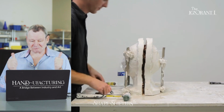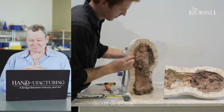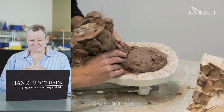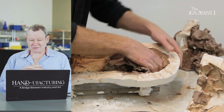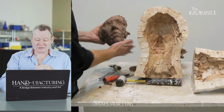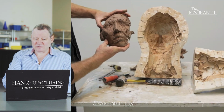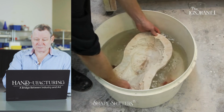The type of mold we're making here is a waste mold, which means not only is the mold wasted after one cast, but also the sculpture is often wasted in the process of pulling apart this mold. A lot of people sculpt in oil clay. But this is okay if we've made a good mold because the sculpture is captured in the mold in the negative. Once you've cleaned out as much of the clay as you can, you want to then soak the mold in water.